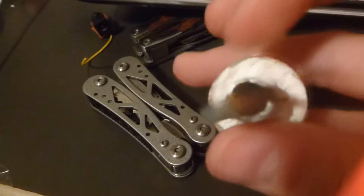This is a different thing that I tried — I have a zinc bar in here and then aluminum. I made this one a different way: I melted all the stuff in it, then jammed the aluminum in, and then put the zinc bar in. If you connect this one and these two together, you get around 0.7 volts, because simple batteries are just copper and zinc. I stuck some zinc in there to try to get a little boost in voltage.